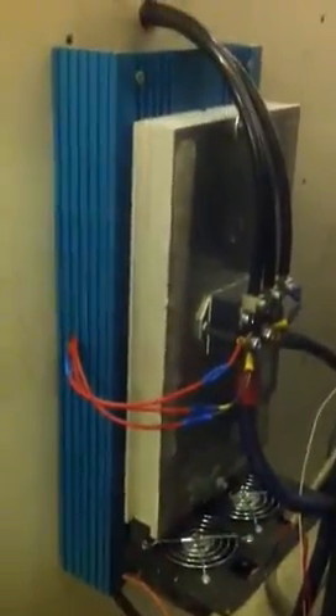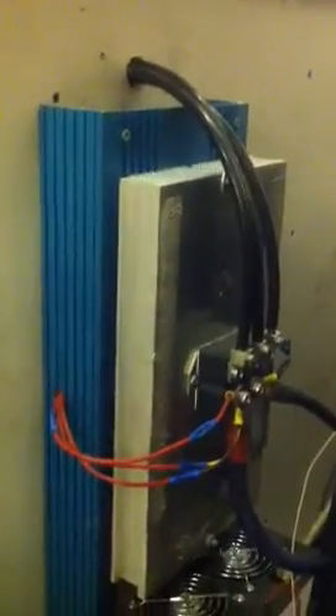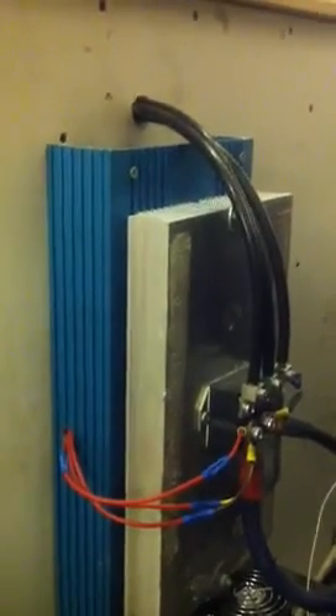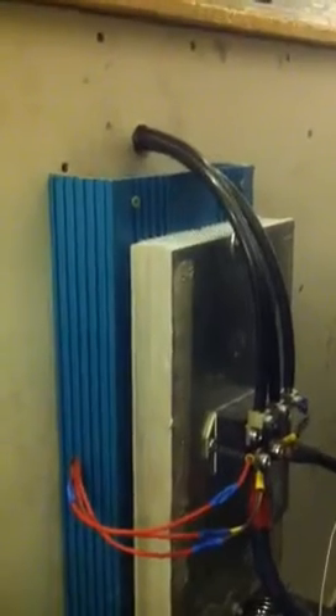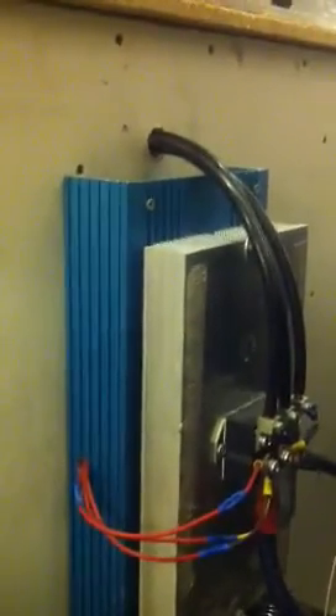So that's my DC charger — very happy with that so far. My battery is about 750 amp-hours, so I like to run no more than 90 amps charging into the battery. When I'm running the heat pump for heating, washing clothes, running the well pump and things like that, I have a rheostat between the charge controller and the alternator so I can adjust it to stay at 90 amps going into the battery and also run the heat pump and whatever else I need during the day.